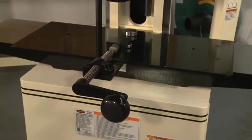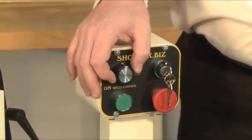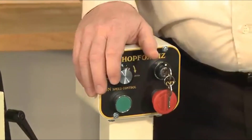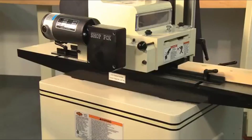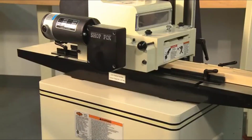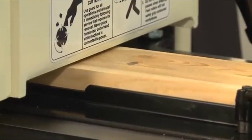The machine's open-end design allows you to make elliptical moldings using the optional elliptical jig — an ideal accessory to create round top windows and arched panel ways characteristic of fine custom woodwork. Conveniently located pedestal-mounted controls feature a variable speed dial and magnetic switch providing thermal overload protection that automatically shuts down if power is interrupted, so your machine won't restart when power is turned back on. The variable speed rate of 0 to 18 feet per minute allows you to slow the feed down for more cuts per inch, handy for deeper cuts or using the elliptical jig.